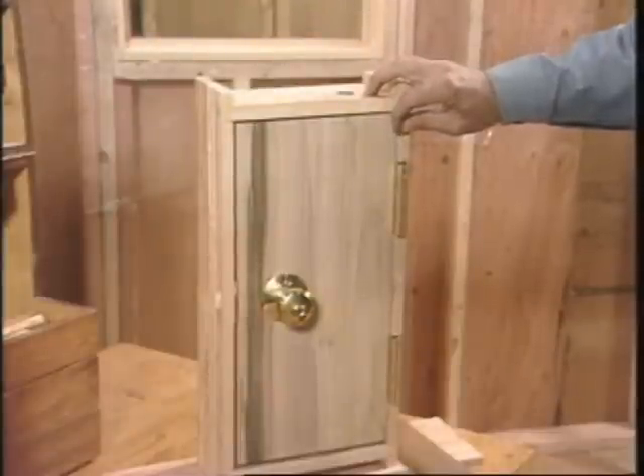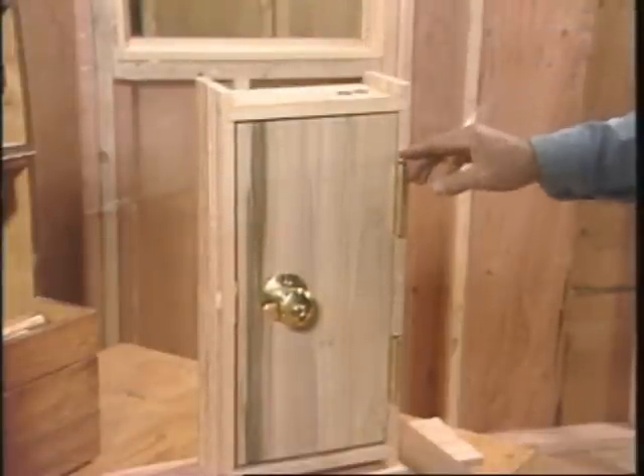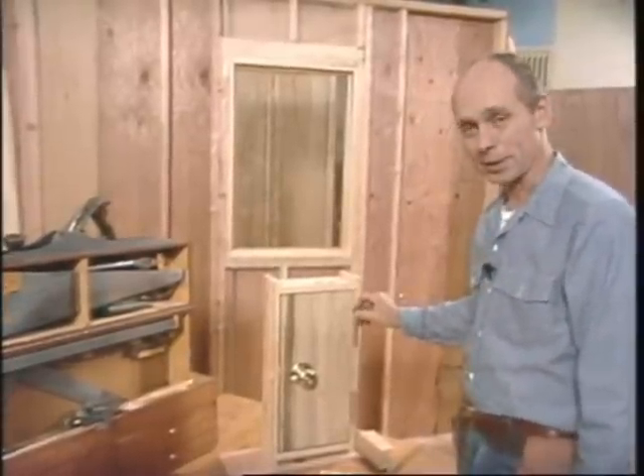There's another way to change this margin, and that's called throwing the hinge. You can shim behind the hinge leaf, and that will move the door either this way or that way. I'll tell you a lot more about throwing the hinge on the next doors that I'll hang.